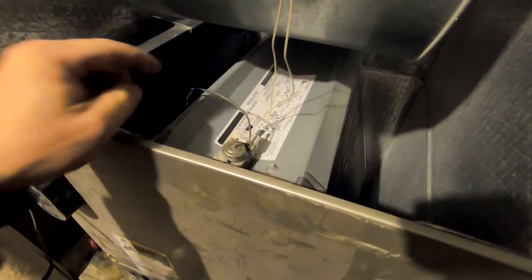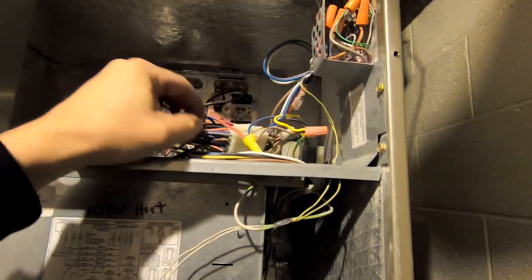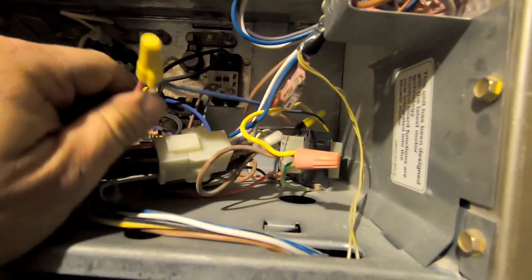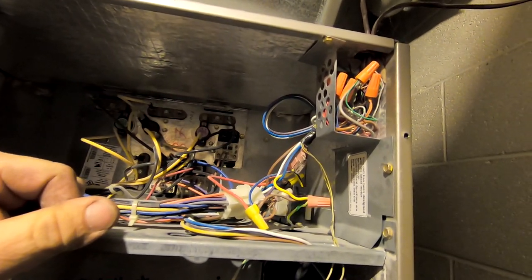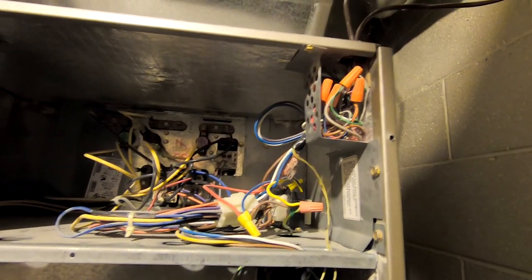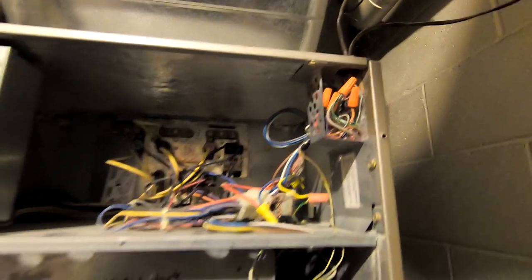They've also added a freeze stat strapped to the suction line, wired in-line, breaking Y going to the outside unit. This unit could probably have been staged for two different banks of elements, but it's only 10KW so they're running the whole thing as one bank. The transformer has also been replaced. Our original problem was a wire that had pulled out, which was not powering the outdoor board — and even when re-wired, it still didn't run. Then we had a random G terminal that wasn't working every time, so to get them by I wired R to G. Today we're back with a new thermostat, new outdoor board — refrigerant charge was already checked and is fine, and the electric strips work.